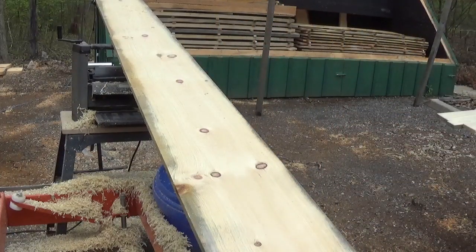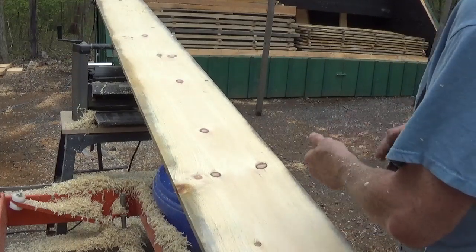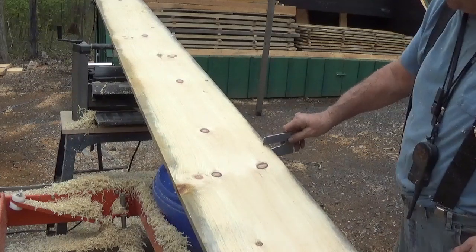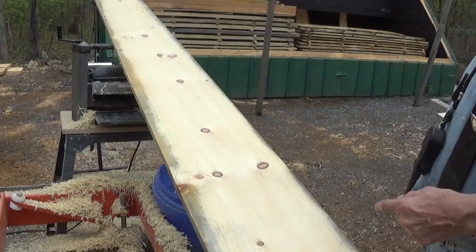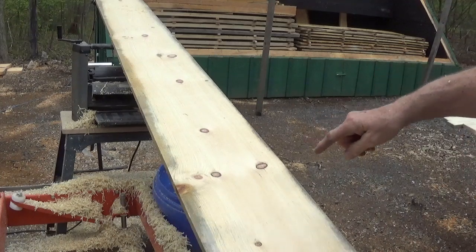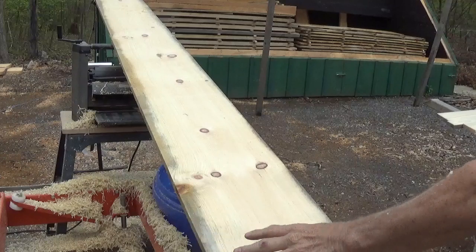If you look at that board, you'll see how wide the board is now. It's got a little bit of wood here that hasn't been planed, so I'm going to go down there one more time. But I'm only going to take it down very little. I'm still just about 7/8, so I got plenty of wood yet to come up with a flat board. So I'm going to go down 1/16 on this face again, just to see how it ends up. 1/16 should do the job.